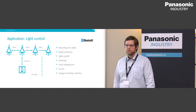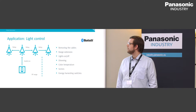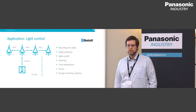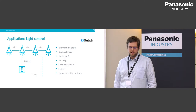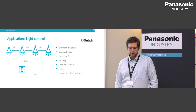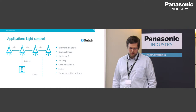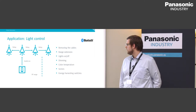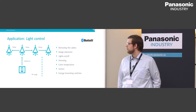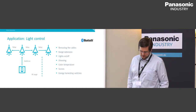One of the main applications of Bluetooth Mesh is light control — removing cables and extending the range of control devices. Bluetooth Mesh uses models to ensure devices in the network are interoperable, covering lights on/off, dimming, color temperature, and scenes. It's also possible to use energy harvesting switches for battery-less devices that control the mesh network by sending Bluetooth Low Energy beacons, which are received by mesh nodes and converted into mesh packets.